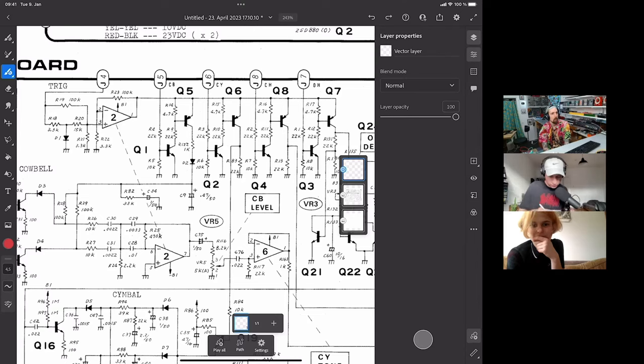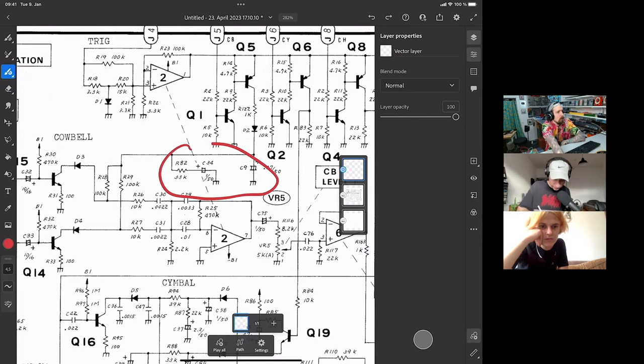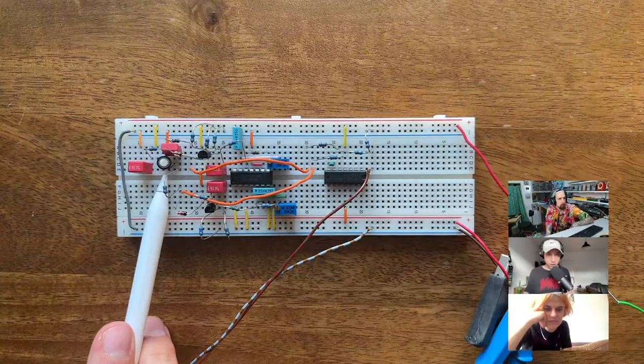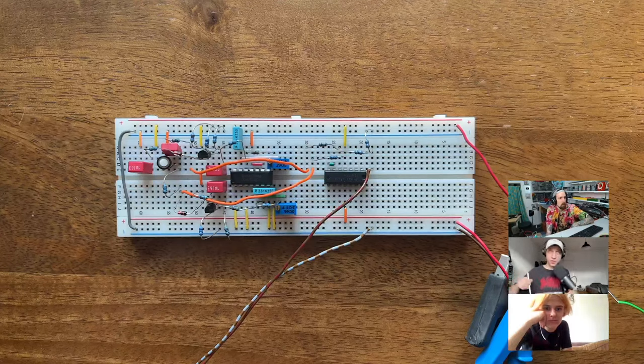In the service manual, we have this section up here, which is a trigger buffer. Then we have this capacitor over here, which charges up and then discharges into the VCA. And then we have this resistor and capacitor, which pad out the tail of the envelope, if you will. I have also set these up on the breadboard, but instead of the triggering logic, I am just using a push button. If I push the button, current flows into the two capacitors, and then those capacitors discharge into the VCAs, and that makes them sound. I'm going to demonstrate that this actually works now.